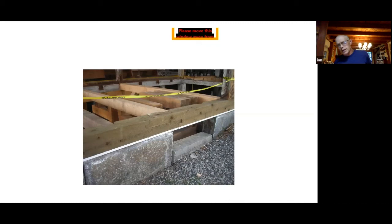Here's a different type of locking lap joint running up a side wall — a flat locking lap joint. The two-inch stubs on either end ensure the pieces have to go together in a straight line and maintain that straight line — they won't slide into each other unless it's a nice straight line. That sill product is an eight-by-eight treated hemlock timber. I still put a little piece of plastic wood on the underside to keep it from having problems. If you're not using treated hemlock, it's better to use a moisture-resistant wood such as white oak — though that's getting harder to get — or tamarack or locust.